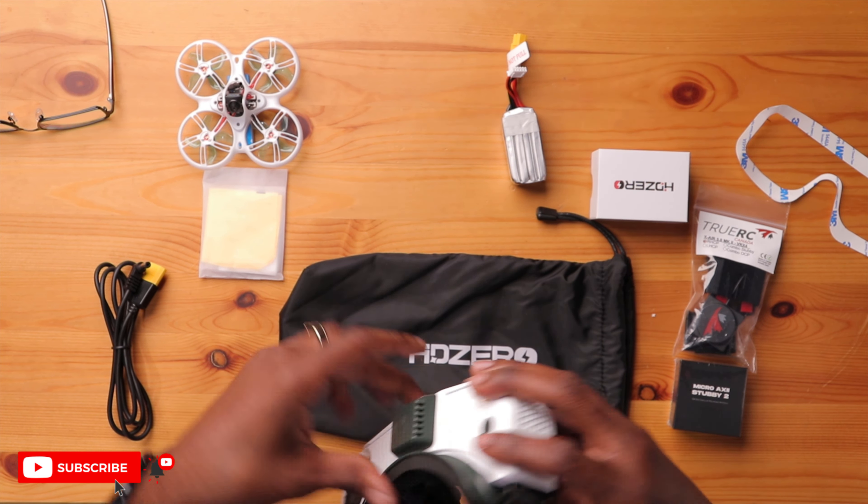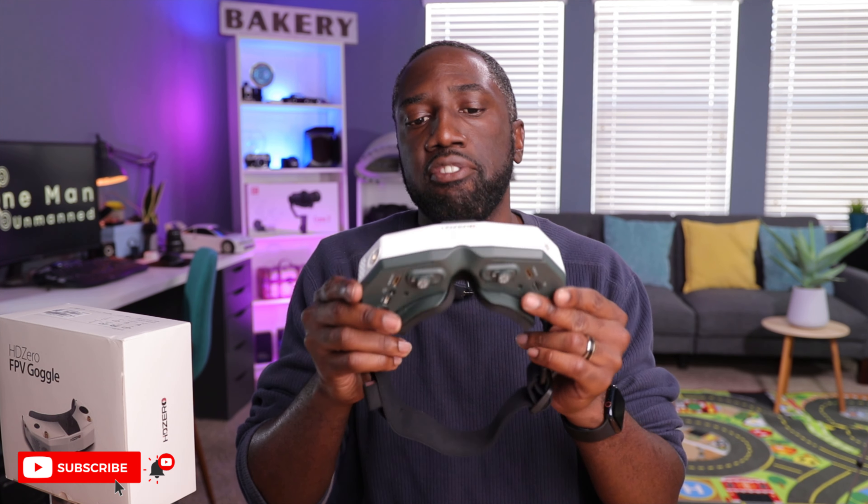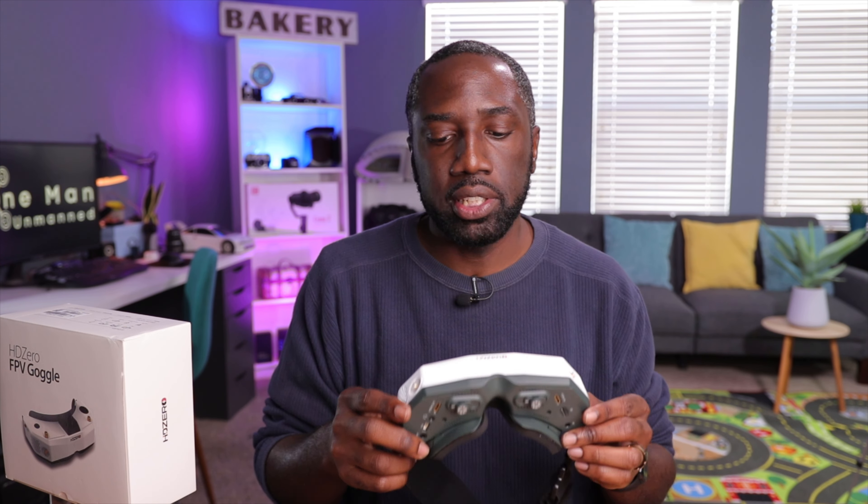Got the SD card in the right way the first time — just put it in there. The next big step is the antennas. Now the HD Zero system only receives — it doesn't transmit — so technically you can power up without antennas, but since every device is designed to operate with an antenna, I like to put them on. You can use any antennas from previous drones as long as they have an SMA connector. You can use two omnis, or a patch and an omni. For best overall performance, most pilots go with a patch and omni combination, and that's what we'll use today.